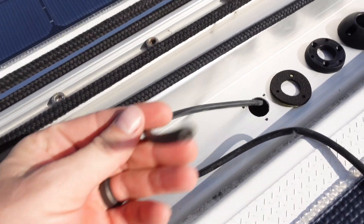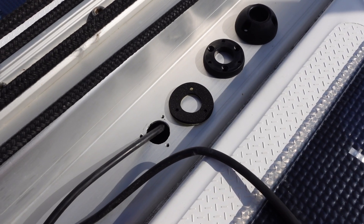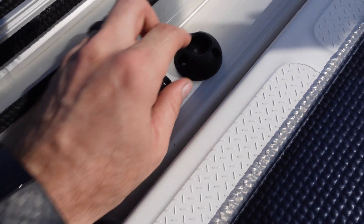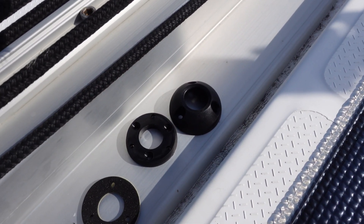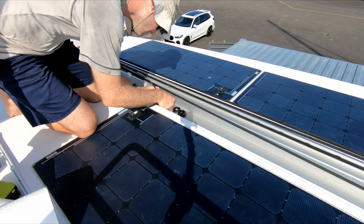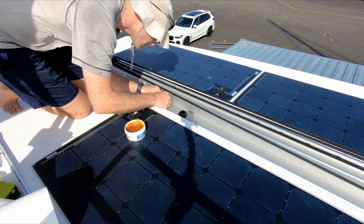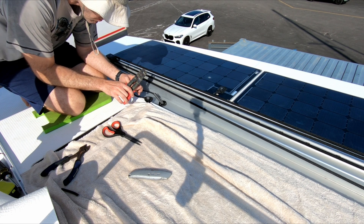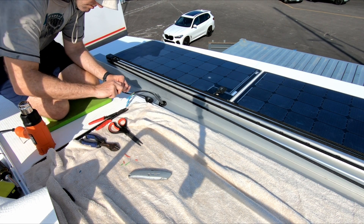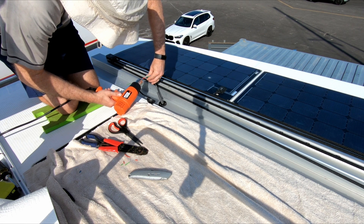I'm just about ready to start splicing wires, which feels good. But we've got to get this scan strut cable clamp in place first, because it needs to go in before the wires are joined. We've got three components: a foam base, a solid base that we'll screw down, and a top part that goes over the wire. Once the wires are spliced together, we can screw everything down. The scan strut cable seal is a really neat setup that gives a nice grip on the wire and is 100% waterproof. My main concern was screwing into the aluminum with a stainless screw, so I made sure to use some Lanicote. These Solara panels have bypass diodes and thus have three wires coming out of each panel — it was a simple process to match up the three wires by color, since I was splicing into the factory wiring of the panel I'd be removing. This is where my obsessive project planning really paid off.